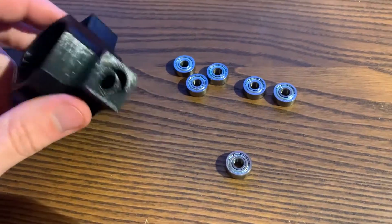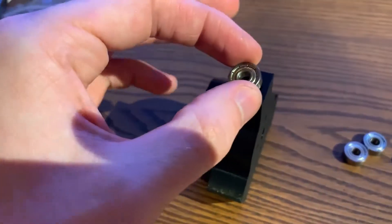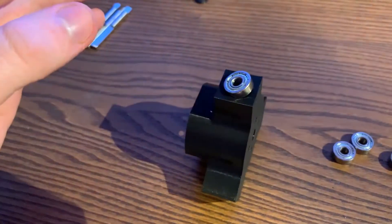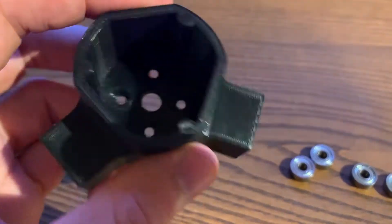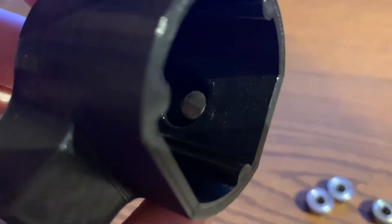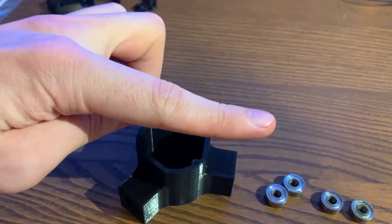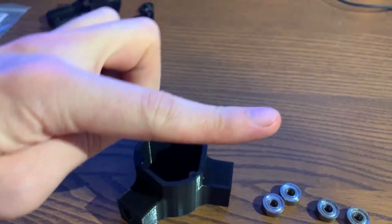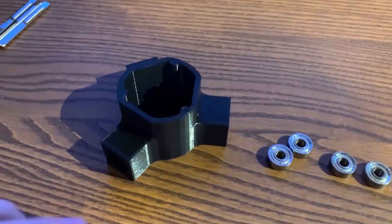The first thing I'm going to do is get these blade pitching bearings in — they'll just slot right in here, and I'm going to hit that with a hammer. There are actually two bearings per blade shaft, and there are three blades: one on the outside and one on the inside as well. The two bearings give it better leverage so when the pitching shaft is in there it's not going to be able to flex upward when the blade is getting lift.